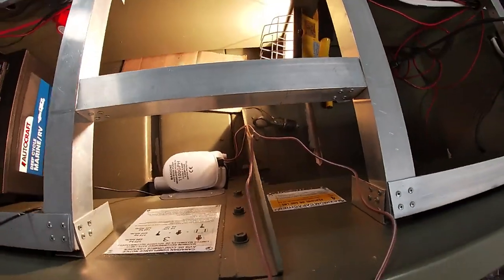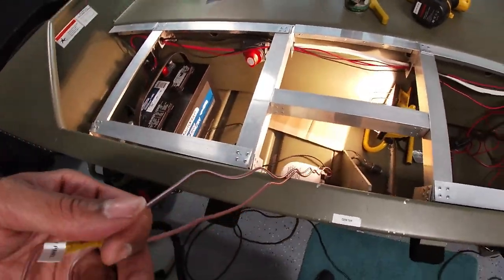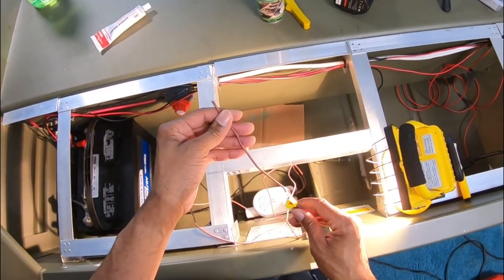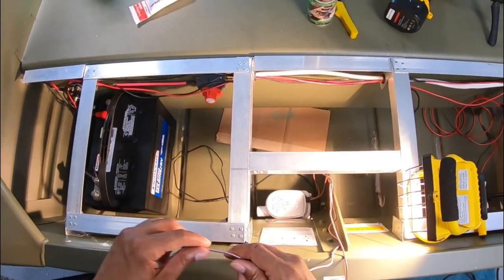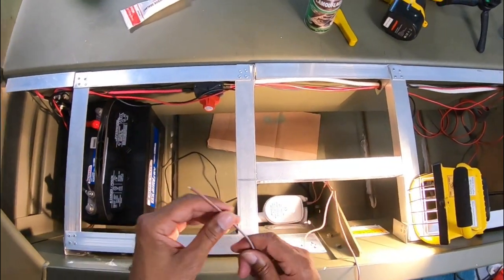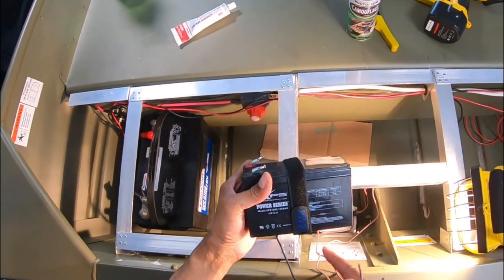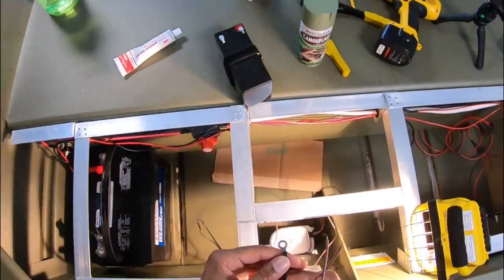Bilge pump is in — it doesn't move around much, so I'm feeling good about that. Next I want to go over the wiring. Most bilge pumps come with three wires depending on the model — you have a ground wire, and then one or two wires for power. This particular model has two power cables. One will be constant power going directly to the switch panel so I can control it manually. The second wire will activate the automatic feature — the pump will automatically turn on once the sensor inside senses that water is in the boat.